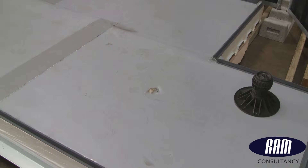If this hole is 1 inch, 2 inches, or even 3 inches deep, it won't reach the profiled deck. Due to the closed cell foam filling every single void between the conductive profiled deck and the waterproofing membrane, even such an extreme penetration will not create a complete earth leakage pathway.